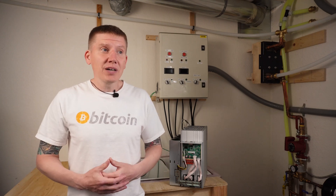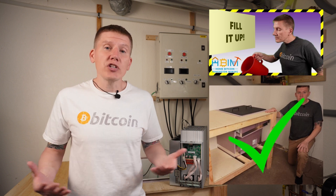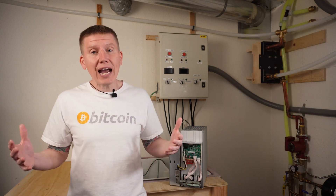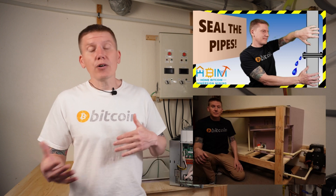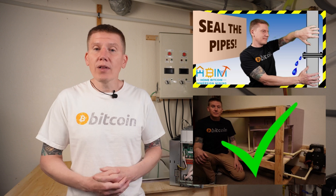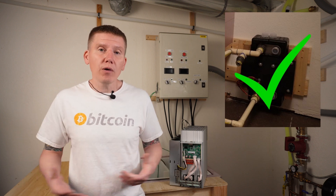Although these setbacks are kind of a big deal, most of the system I designed actually worked really well. Starting off with the insulation on my tank — I used some garage insulation and then some one-and-a-half inch foam board, and that did a great job. When my system was fully up and running and I touched the side of the insulation, it was basically at room temperature. So in my small room here, where I really have to manage how much heat is coming off my tank, my insulation scheme worked great. Looking at the piping and the pump for my miner cooling loop, everything worked out really well. I was a little concerned going with three-quarter inch piping, wondering if that would be enough — and it was plenty big. My tank never got above about 100 to 110 degrees, and I think I have tons of margin if I want to go to overclocking in the future. And following that is my heat exchanger. Sizing a heat exchanger is kind of tricky and not straightforward — you have to make a few assumptions. And again, the size of my heat exchanger was perfect. My system stayed under temperature, and fluid flow through both cooling loops went really well.